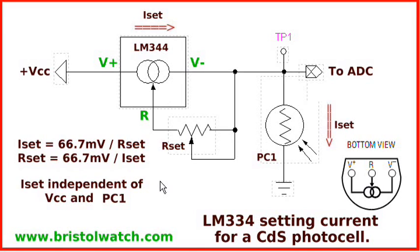Those circuits will also be discussed in this series of videos. You can do a lot with an LM334 — they are widely available on eBay for less than a buck, and at Digikey as well. The device is cheap, and you can do a lot of things if you've got thermistors or photocells that you know something about. That completes this introductory lesson on the LM334 constant current source.